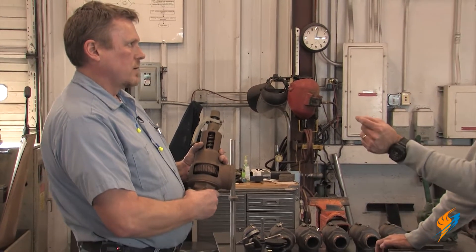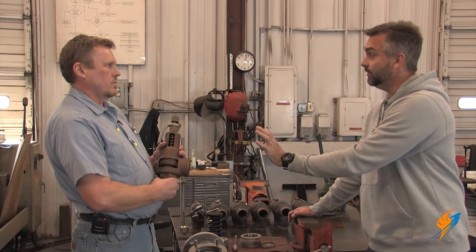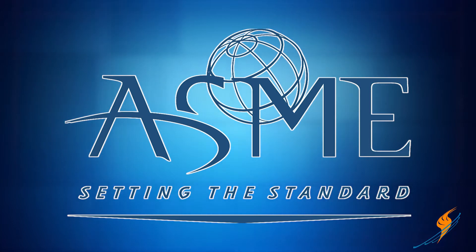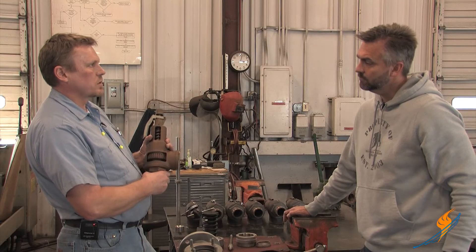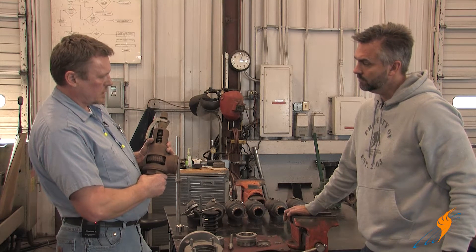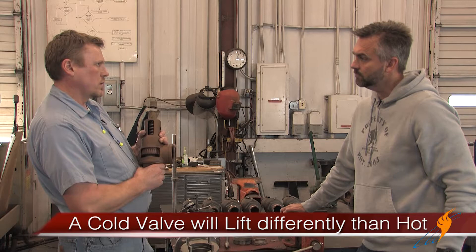So the relief valve is actually, let's say, set at 125 psi — the valve is going to lift right at 125 psi. Yes. ASME code tolerance does give you plus or minus 3 psi on a valve set at that pressure, a section one relief valve. So when we bench set the valve, we can adjust it accordingly when we're bench testing it. We tend sometimes to set it a couple of pounds higher only because the valve is cold when we're testing it and when it goes on the operating system it's sitting in a warmer environment.